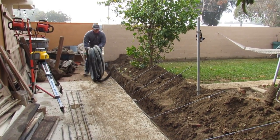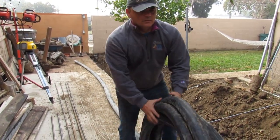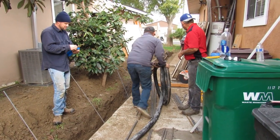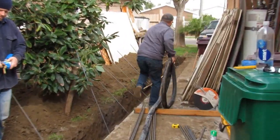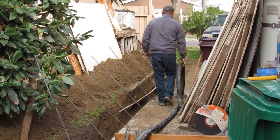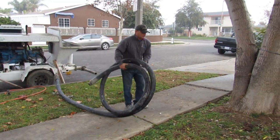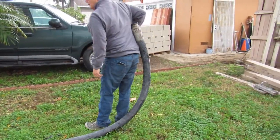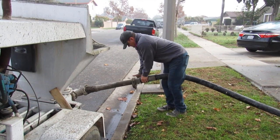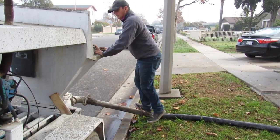I'm winding it out. I'm just pumping a footing today so it doesn't really matter what slump I pump it at because they're just gonna wet set it and put the first block in. That's a two and a half inch hose — those are 25 footers. The two-inch hose are 50 footers, so I have 125 feet of hose out.